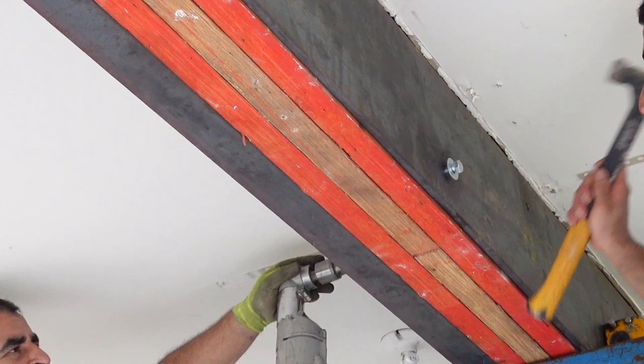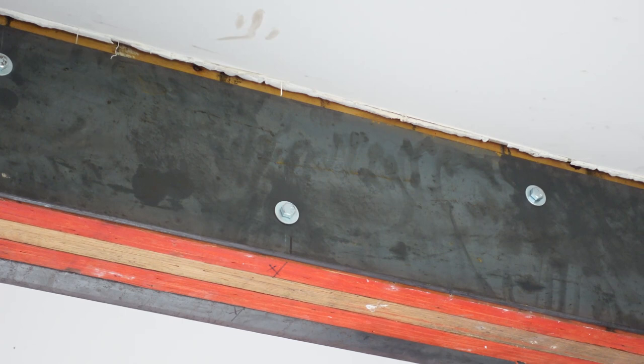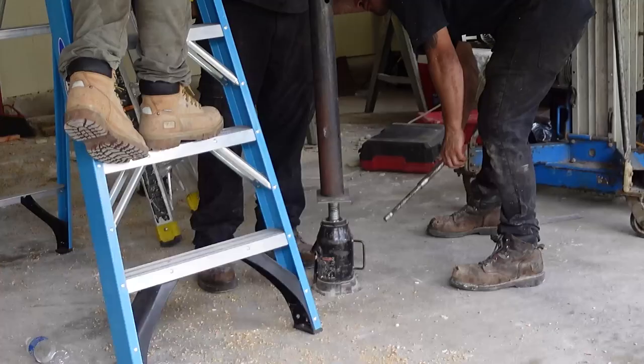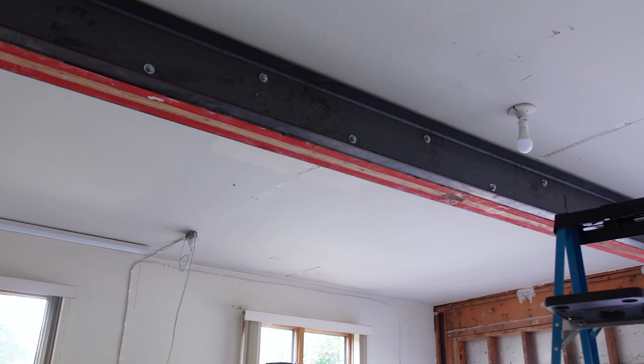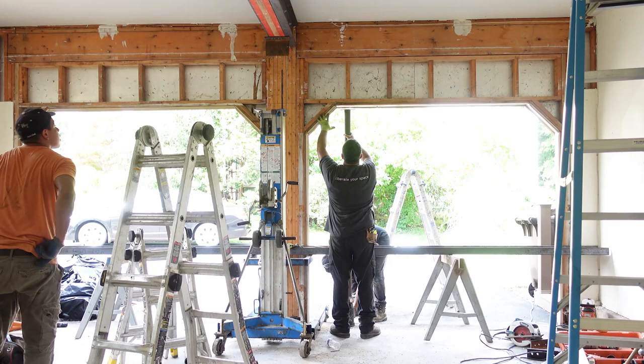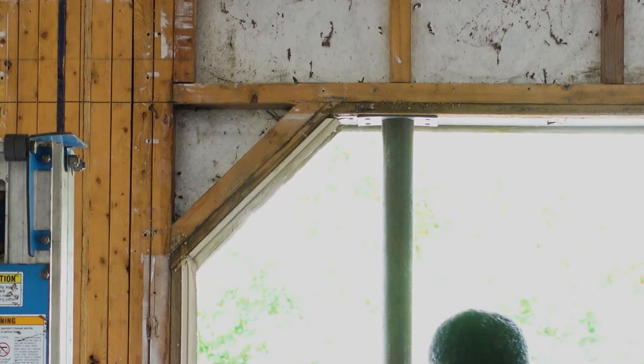The beam and the reinforcing steel were cross-drilled and bolted in a staggered pattern every 16 inches. Yay! This is very exciting. The reinforced main beam was now holding up the house without the lally column. It was time to reinforce the garage door headers into a single span so we could knock out the existing garage door separation. Jack posts were put in place